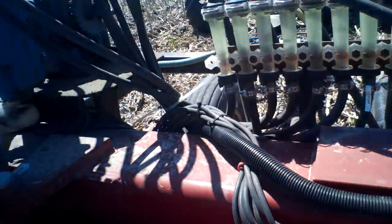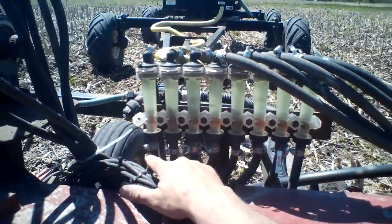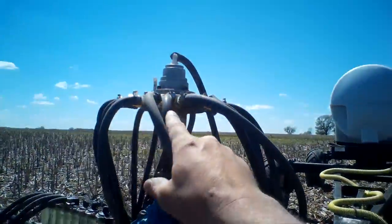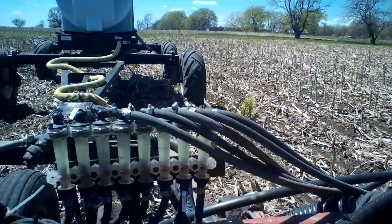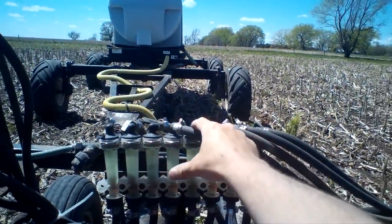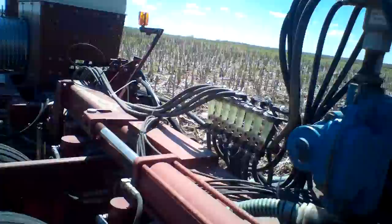I can't run it further down because when I go down to put less fertilizer on, the balls don't lift up. These are weighted but they're a pain to change very often, and I do change fertilizer rates according to what my customers want. Each one of those tubes goes into a bottom fitting, and each one of the top rows goes out to a row — one through eight on one side, nine through twelve on the other.